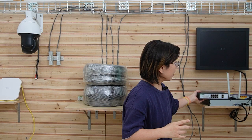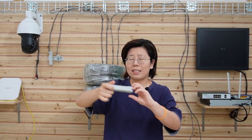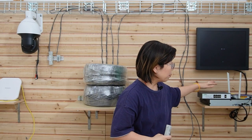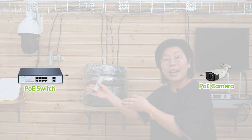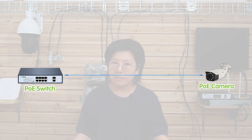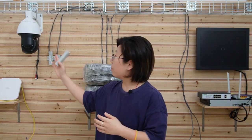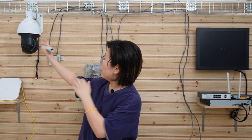That's why we need to add this switch — to boost power and data. But if you look carefully, you'll see we also have a PoE extender here. Why do we still need one? The long-range PoE switch can provide power and data up to 500 meters, but our edge devices are just ordinary devices — they don't have the special chipset to send power and data back to the main switch. That's why we need a PoE extender, so the edge device can send data back, because there has to be an exchange: the switch sends power and data, and the edge device sends data back so we can receive the image.